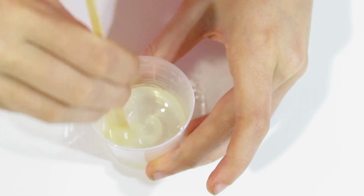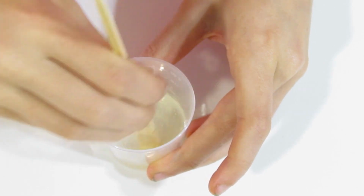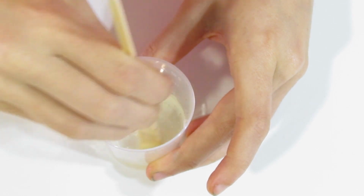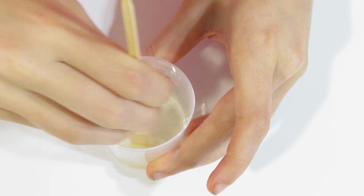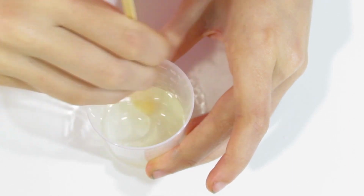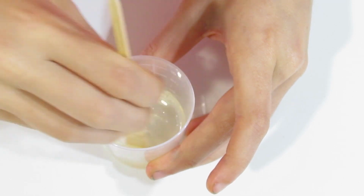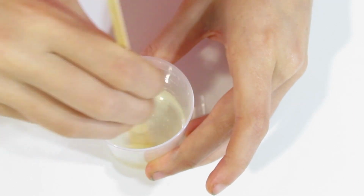And that is what you would do with generally just about any brand of two-pot resin. However, if you're getting a different brand, just make sure what the quantities of each need to be mixed together. Some it is equal parts mixed, some it is 2 parts one and 1 part the other, so just make sure that you're getting those quantities correct.